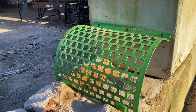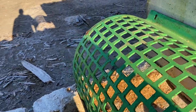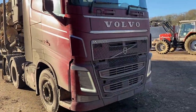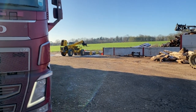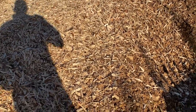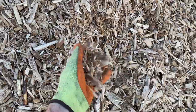Yesterday Dave took the screen out. We don't even think it's a G30 — we think it's too small — but we've got a G50 screen which is a lot bigger and we're going to give the chipper a try and see how it produces chip for us. It's arrived — hurrah, we can keep cutting. I just had a little go on the chipper — it's not too bad. I've been using the R logs and it's a slightly better chip now actually, coming out more as the G50 ought to than that smaller stuff. It's a little bit more fines than the other one I'd say.